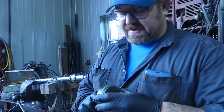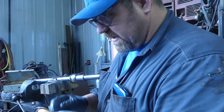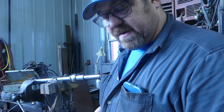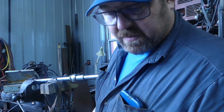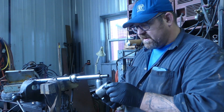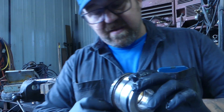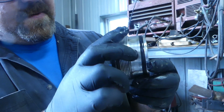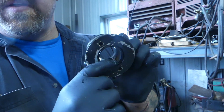Be right back with the old faithful - IR three-quarter with a big airline. I wonder what the foot-pound torque rating is on this old girl compared to that electric. Air still has its advantages. Piston actually looks okay. It doesn't come with a piston seal - well, maybe this is the piston seal, we'll double check that. The wipers don't get replaced - sometimes you have to buy the whole piston. That's how it looks on this one. Spacer, no taper, head gland. And the reason she's leaking - we have a split seal there.